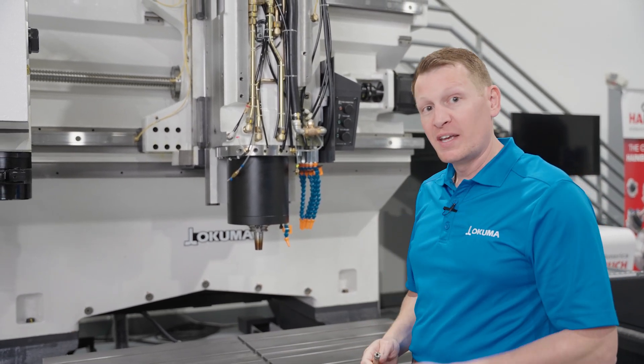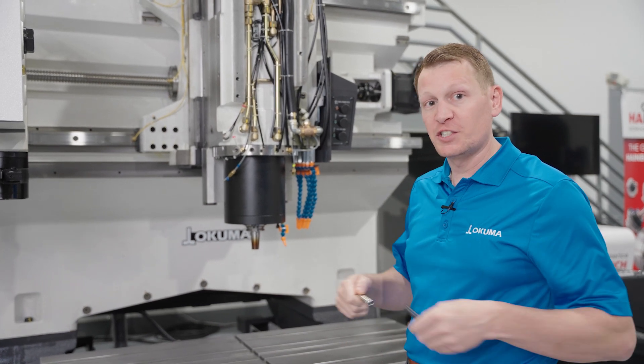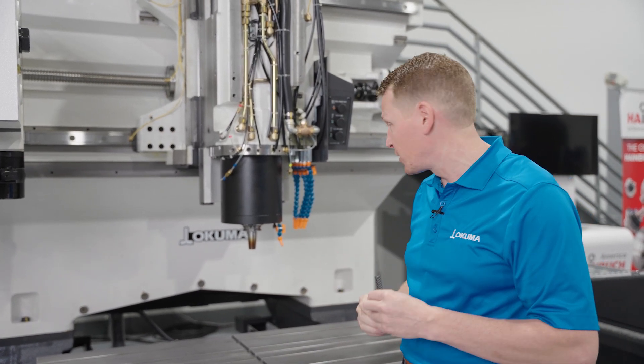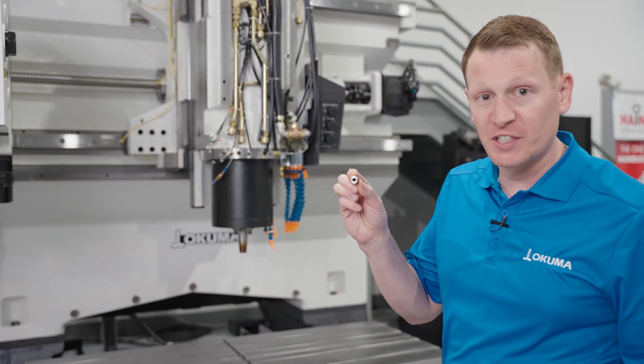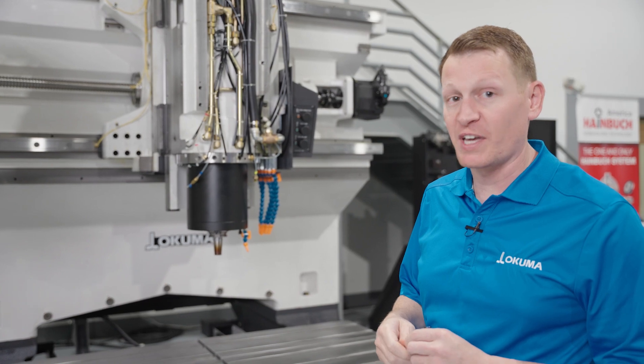Change the coolant pin, take the spring out, change the linear spring, change the ring spring around the collet fingers, and then reassemble. That way you know that you have a perfect seal with a new coolant pin and your spindle unit will be protected.